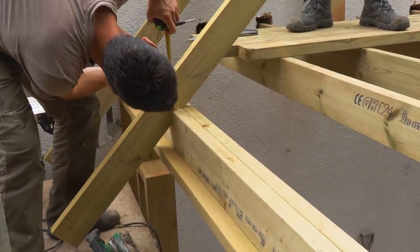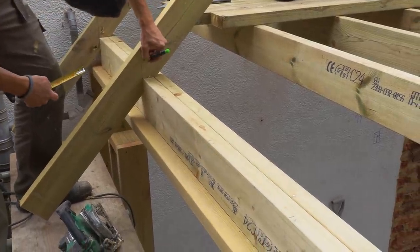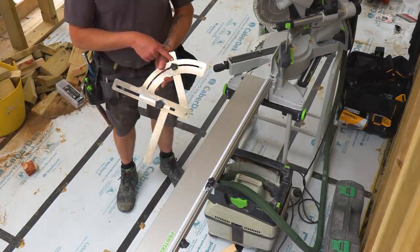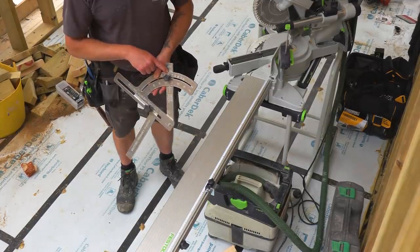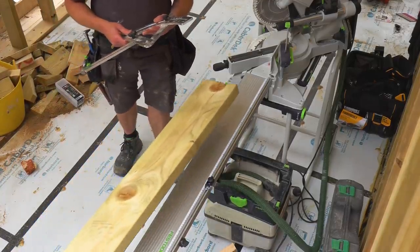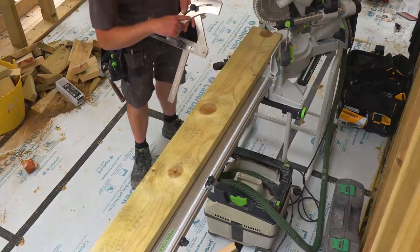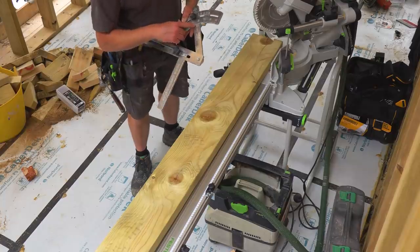The height above plate is 115mm. HAP. So we set our hips to 45 now - we were on roof pitch 45 and now we're on hip 45. Should be within 9 to 11 degrees different. It's about... 45 was there, yeah - 9 and a half degrees. Just shows you doesn't it?